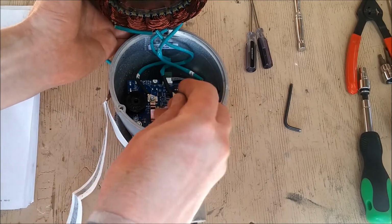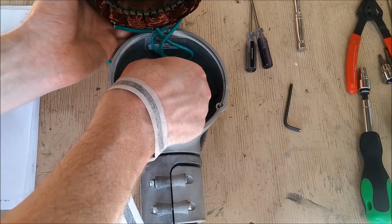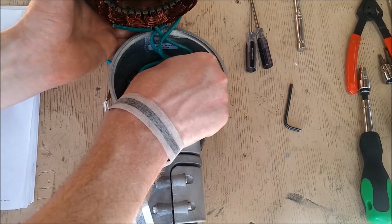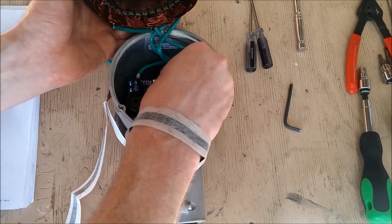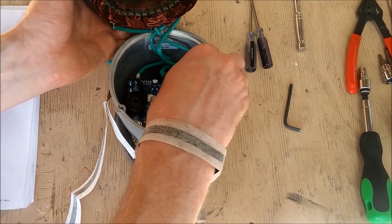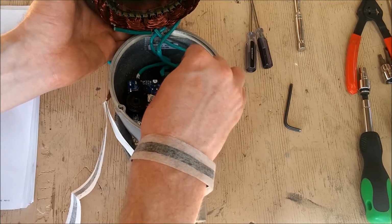Using a 7/64 inch Allen key, remove the 3 small screws connecting the stator wires to the circuit. Note that it is very easy to strip the threads on these screws, or even crack the circuit board when you reattach these screws. So it's important that these screws be later reattached in the same manner and torqued to 10 inch-pounds as specified in the circuit replacement instructions.